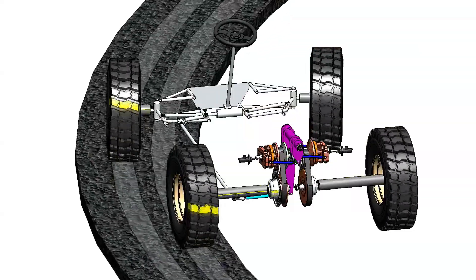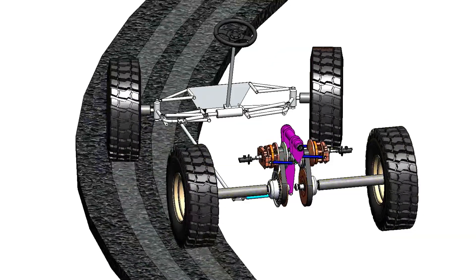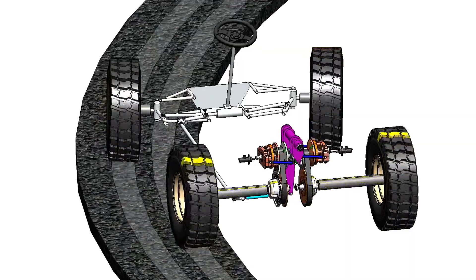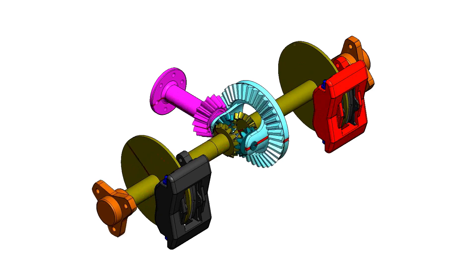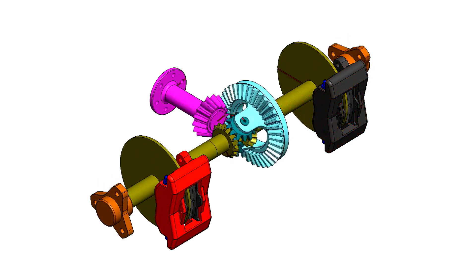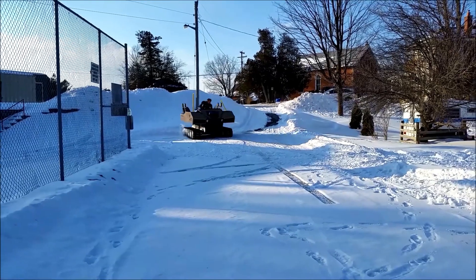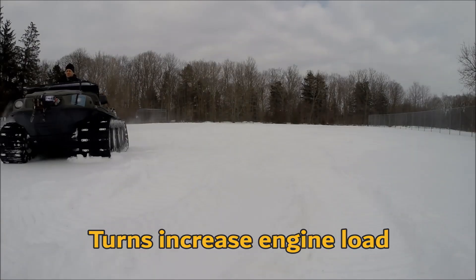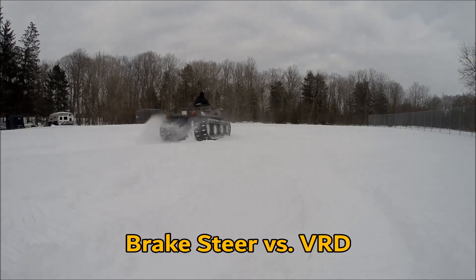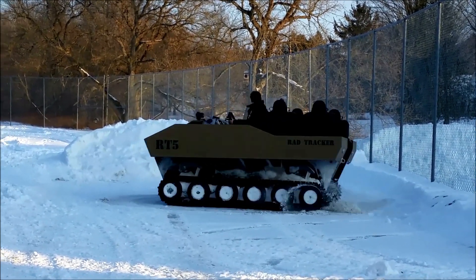It is very important to understand that VRD can deliver all the power to one wheel when the other is off the ground. A spool or locked rear end can equally do this, but they have no differential capability. A brake steer is an open differential with left and right axle brakes to control direction of travel — also called differential steer, skid steer, tracked steer, or tank steer. At Rad Tracker, we prefer specific terms: a pivot turn means one track stops while the other drives; zero turn means both tracks turn in opposite directions. The same mechanical principles apply as with the open differential — half the torque goes to the brake-applied axle, the other half to the driven axle. The driven axle doubles in speed when one side is stopped, and either axle can only receive half the torque.